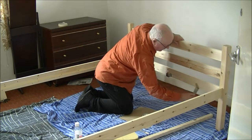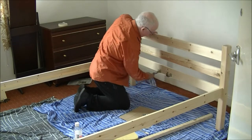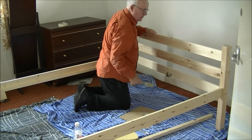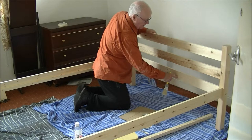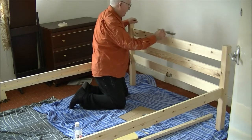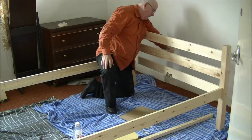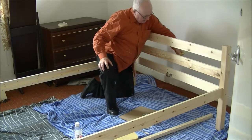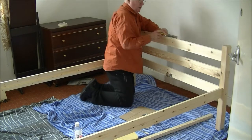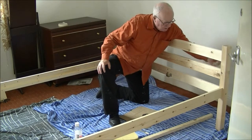That's how we would do underneath. So we have now done the back. We won't touch the top at the moment. So what we'll do, we'll move up to the next one — same again. So we're now painting the second one up. It means we're not sticking to the lower one because it's not been done yet. So let's go along again — remember, not too much varnish on the brush.